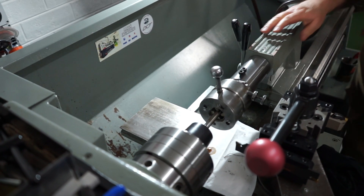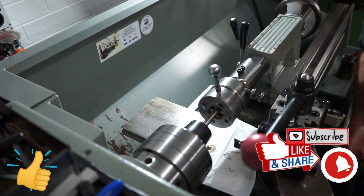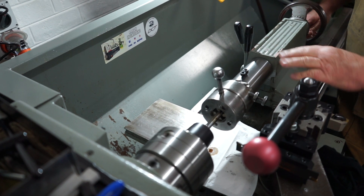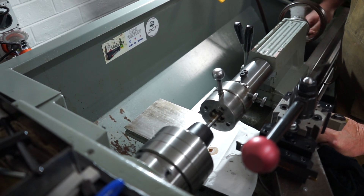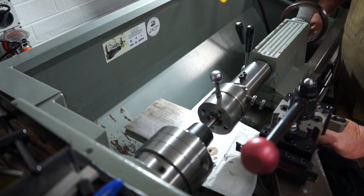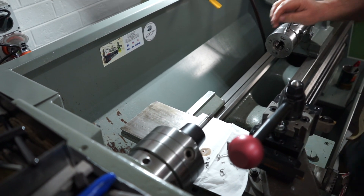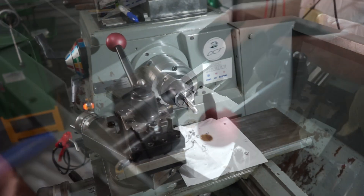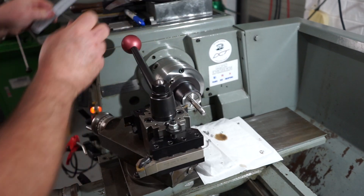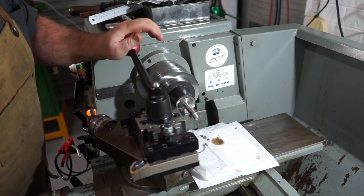Lock the tailstock. We're just going to go down in the RPM — 72 RPM. All right, here we go. And I'll start feeding now. Five. Disengage. And ladies and gentlemen, there we have it — there's our thread. We're parting off just over two inches. There we go.